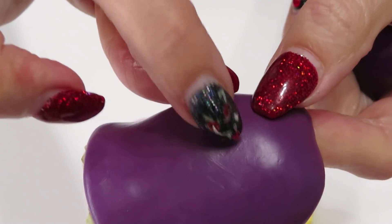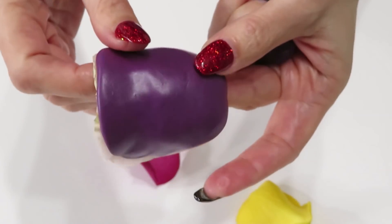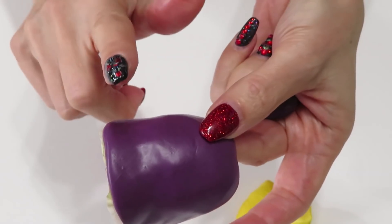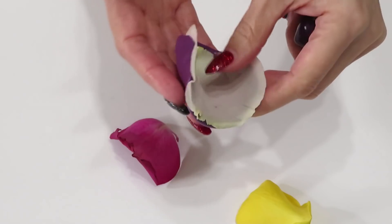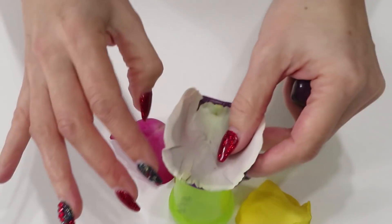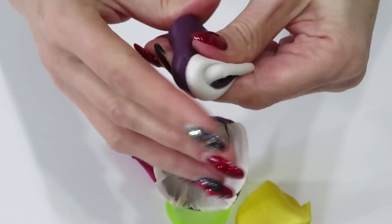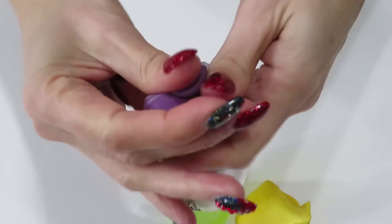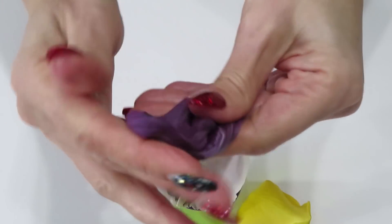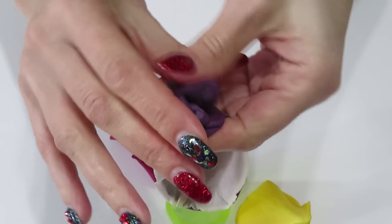It's been about 10 minutes. If I push now it doesn't make any mark from my nails - it's already resistant so you can't mess it up now. But if I have to de-mold I have to wait at least half an hour so it's fully fully cured. Because we're not de-molding yet, we're going to continue and mold the inside. Now I'm going to mix another same amount - you can use less if you want, but we want to make a two-part mold. If you want just one part you just de-mold right now and you have your mold. But because we want two parts, when you put your clay inside and press with the other one, you will have a perfect petal with all those veins from outside and inside.